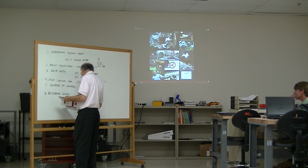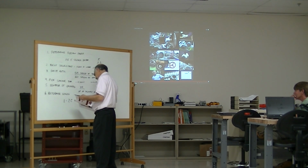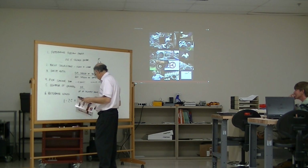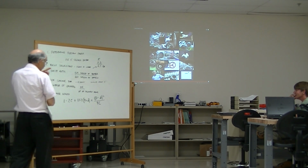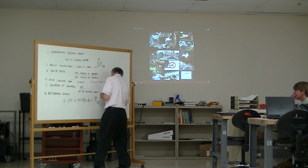2C plus 1.57 times (D plus d) plus (D minus d) squared over 4C. Man, what a formula. Holy mackerel, I gotta do all that to figure out length. What are all those letters? Oh, we're gonna go over that. It's a good question, Steve. Good question. What are all those things?